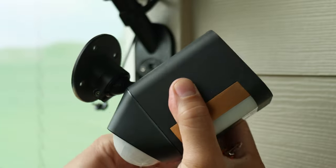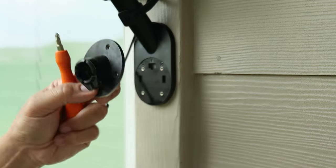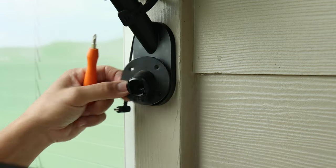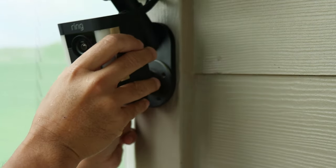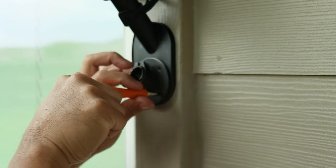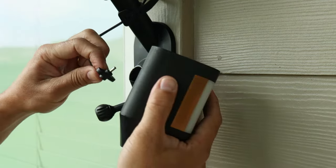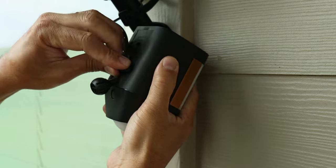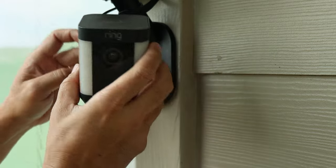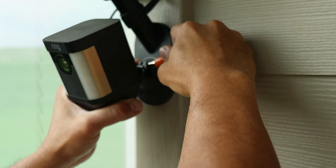This is my almost five-year-old Spotlight Cam and it is still working. I just need to remove its mount and the hole should line up with the one on the solar panel mount. You can place the spotlight mount pointing up or down depending on how you set up your Spotlight Cam - I have to install mine pointing up. Screw it in using the four included machine screws. Plug in the barrel plug from the solar panel to the power port on the back of the Spotlight Cam, then push the Spotlight Cam into the mount and tighten the mount collar to secure it in place.